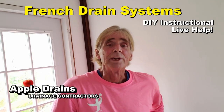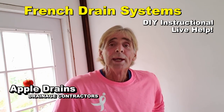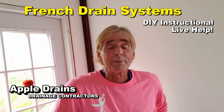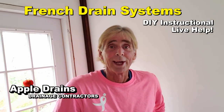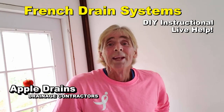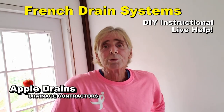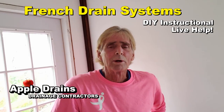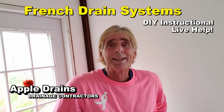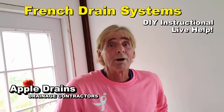So you saw in the first video how the channel drain is so versatile — it's picking up driveway water and also preventing a flood that's been going over to that neighbor's house. That was pretty dramatic; that man had to call and complain. But we solved that problem and actually went and did a job for him as well. The second video is showing you some of the tougher jobs we come across. This one is in a backyard where the soil is so bad — we put in over 400 feet of pipe on here. It works great. French drains, if you get them in properly with the right catch spacings, you will solve your problem.